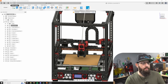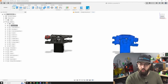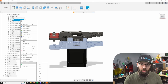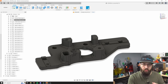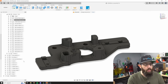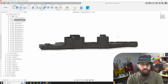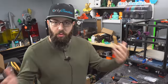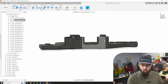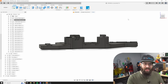When we look at the Voron AB motor mounts, to keep things simplified, I'm essentially machining just one motor mount — the B motor mount — and mirroring it. We have an upper and a lower part. If we were to machine this part as-is using subtractive manufacturing, we'd need stock material as thick as its thickest point, as wide as its widest point, and as long as its longest point. That involves a lot of waste — basically everything in the middle section gets turned to chips, and those big cutouts are machined away, removed, thrown in the garbage. If you wanted to machine this one-to-one, that means increased time, increased material cost, machine time, et cetera. So we want to simplify this as much as possible.